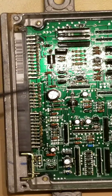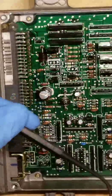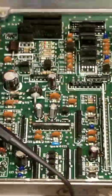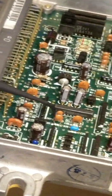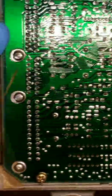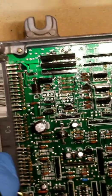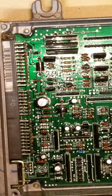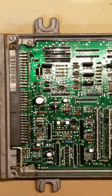You're going to be looking at the capacitors — you really want to get in there and see if there's any burn marks down there or anything. You're really looking at all of these and checking to see if anything's burnt, then flipping it around and looking at the circuit board to see if anything's burnt or any trace burns. That's how you're going to find out if you have a good ECU to start with. If you have blown capacitors and the board looks really bad, it may not be worth it.